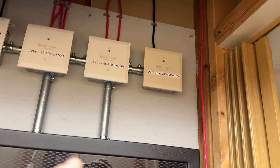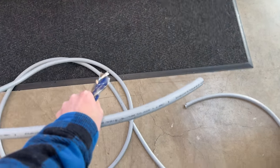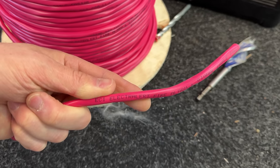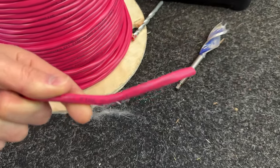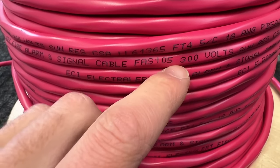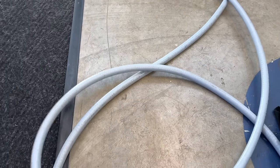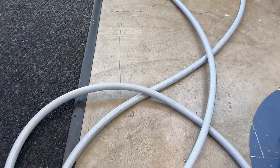So the plan is to add another isolator and get the fire alarm cable up there. This is the LiquidTite Flex I'm going to run between the two buildings, just as a sleeve for the fire alarm cable. I'm running some Electra Alert fire alarm and signal cable — FAS 105, which is 105-degree rated, 300 volt. But that stuff is not meant to be wet, it's just like NMD. That's why we're going to put it in some LiquidTite Flex as a sleeve between buildings, which is completely allowed. Unless it's a burial application, then it should be a burial-rated cable.